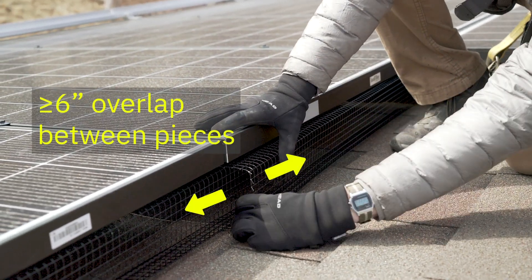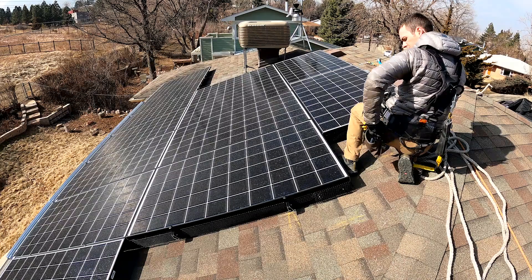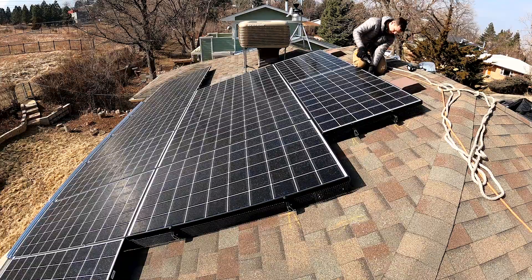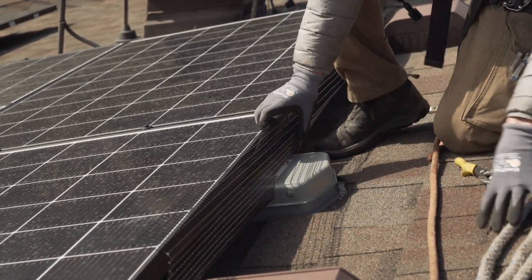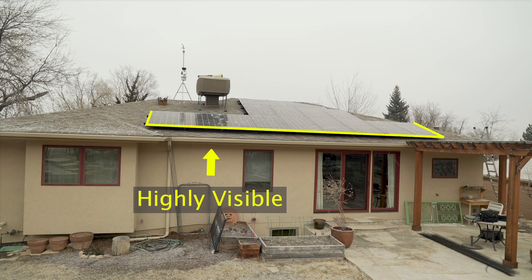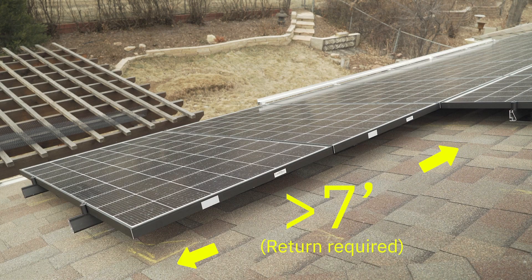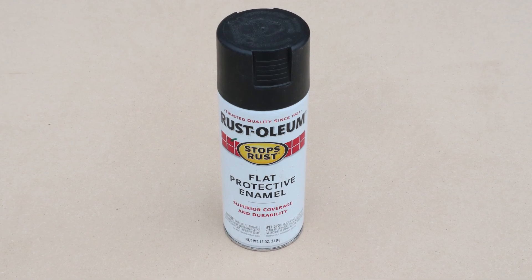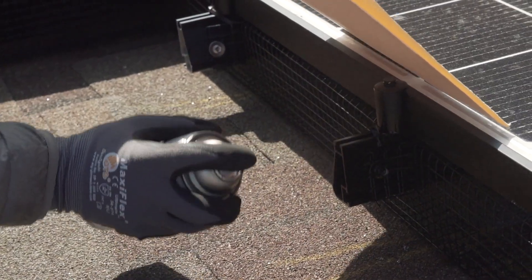Overlap the next channel with the previous one by at least 6 inches. Stitch unions together using at least four hog rings or two zip ties — put a bend in the zip tie so that you can thread it in and out. Keep working your way around the array, installing 10-foot channels. Make cutouts around penetrations such as conduit or vents, but make sure the fit is tight and use hog rings or zip ties as needed to secure loose corners. It never hurts to add extra support to sections that will be highly visible from the ground or extra exposed to weather — strengthen these areas by using longer overlaps at unions and reducing the spacing between returns. When you're done, go back with a can of spray paint to hit any exposed fasteners or zip ties. Don't allow any overspray onto the array, and if it's super windy you might want to skip this step.